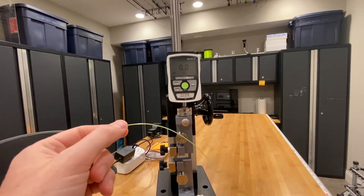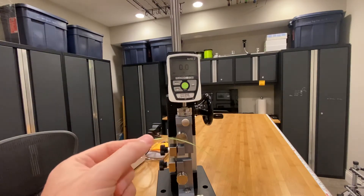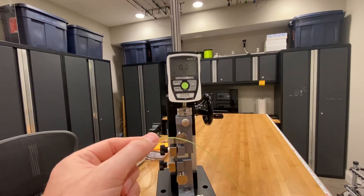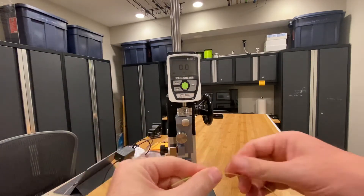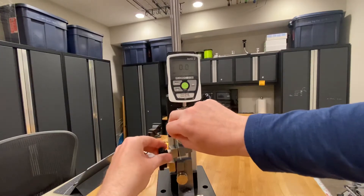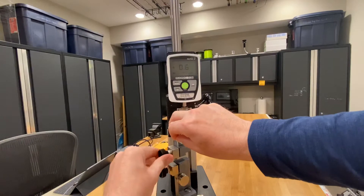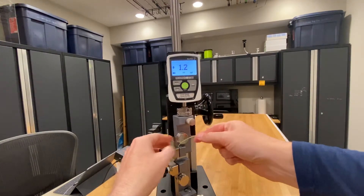Because this sample is dry and I have not soaked it for two hours, I expect it should break in the low 120s — maybe 124, 125, somewhere around there. Let's see how it sets up and we'll do the test. These are called bollards, and each one has a little finger vise. I start the sample by screwing one end of the line into that top finger vise.